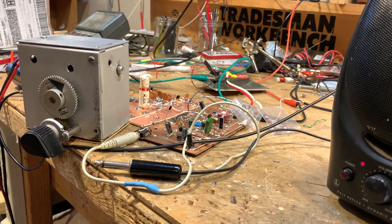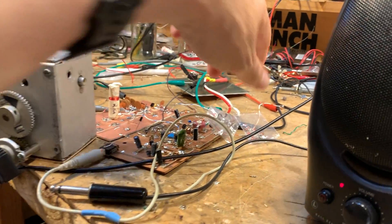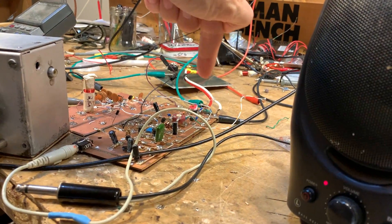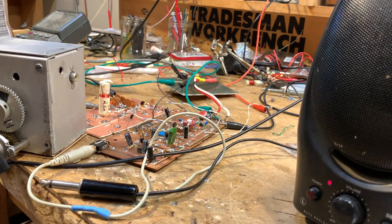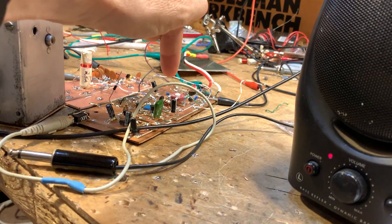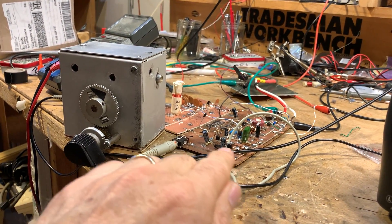There's a JFET, and then it goes into the main board. I have one little FET in the front end, one very simple bandpass filter, and one two-diode mixer.